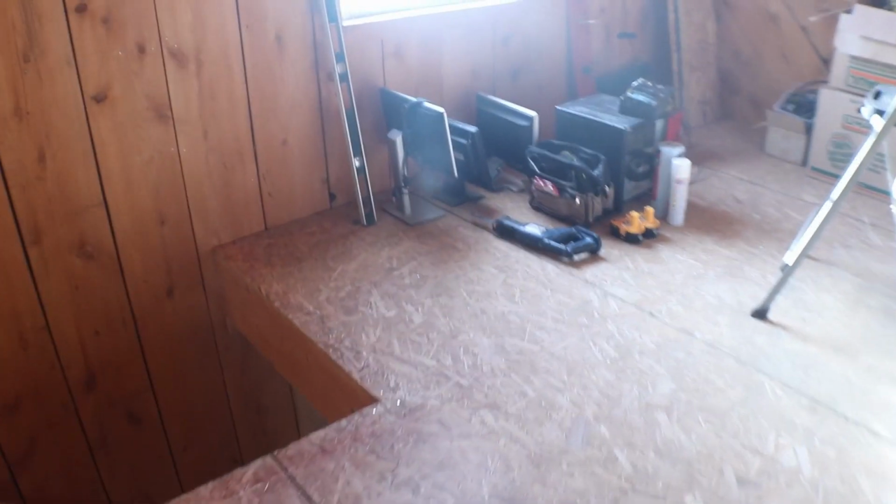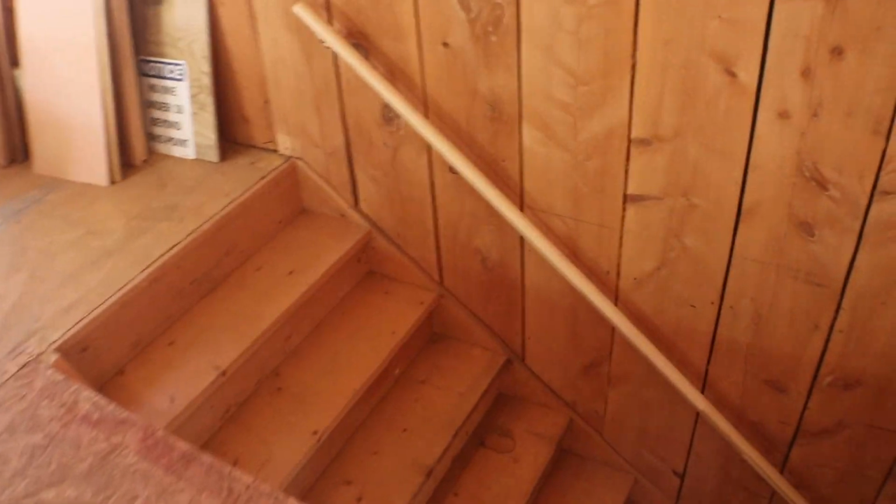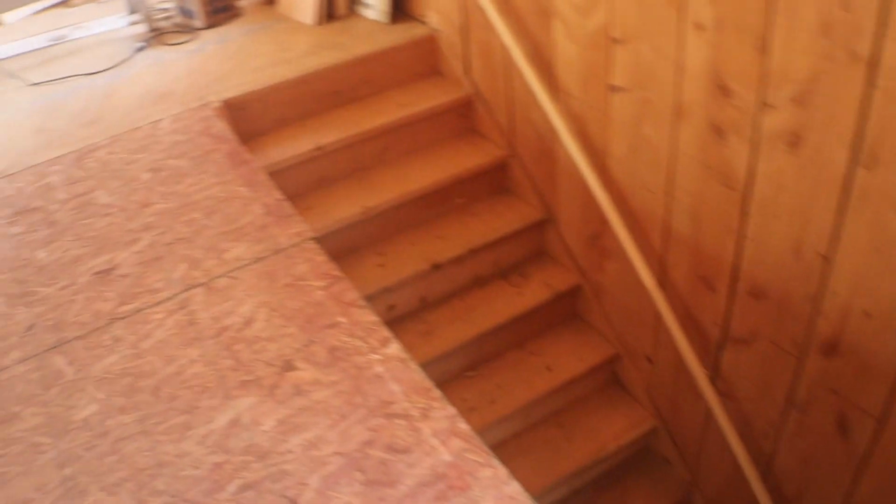All right, first thing we need to do is determine that we want our little wall about 42 inches high. That's, like I said, pretty good as far as adults not falling into it and falling down into the hole. So our bottom plate, I checked to see how old these 2x4s were. They're 1.5 inches. Anymore, you got to measure all this stuff to see what they were making it at that time. So our bottom plate's going to be 1.5 inches, and our top will be 1.5 inches. So that's 39 inches on our 2x4s.